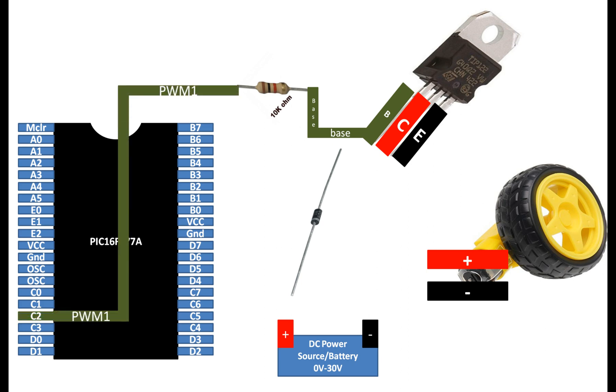From the other end of the 10 kilo-ohm resistor, connect it to the PWM pin of the PIC16F877A microcontroller. You cannot use any available pin — you have to use only the specific pins mentioned in the datasheet as CCP1 and CCP2. CCP1, which is the PWM1 pin, is pin number 17, so I'm going to use this one. The collector pin of the TIP122 NPN transistor will go to one end of the diode — the end that is opposite to the silver cut band you can see on every diode.